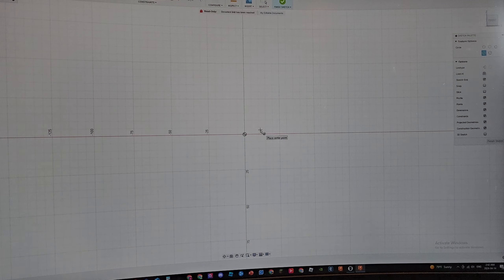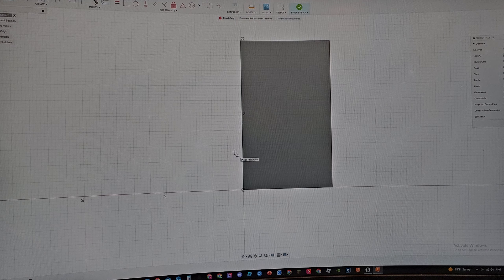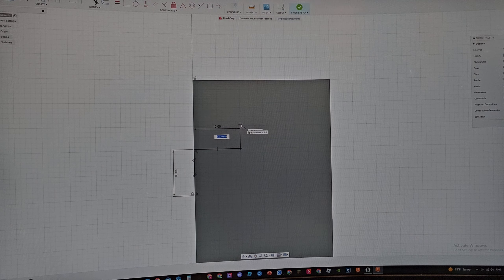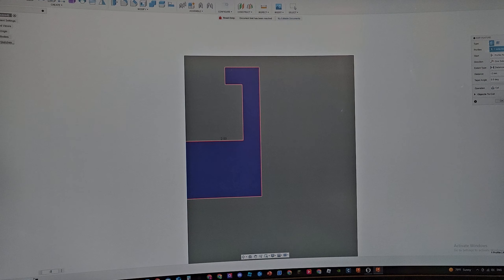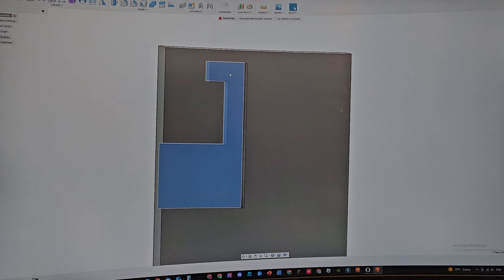Starting with a new sketch in Fusion 360, I make a box — let's do 30 by 50 mm — and extrude it about 5 mm. I make another sketch, find the midpoint, go up by 10, make another line by 10, and go up by 10 again. This is where you make what I call the triangle lock. I'll do 3 mm here and 3 mm there, adding up to 6 mm. I extrude this by negative 2.5 mm — that's the look of the inside.